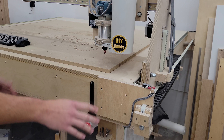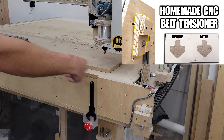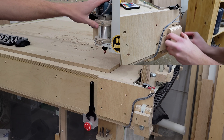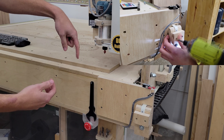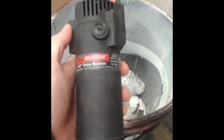The next thing that was done was adding the belt tensioners to the X and Y axes — two on the Y axis and one up here on the X axis. In that same video I changed out the Harbor Freight router for this Makita one, because the Harbor Freight router's bearing must have gone and the bit was wobbling around, giving me horrible results when I was trying to do inlay work.